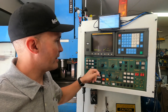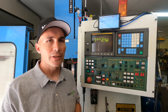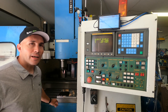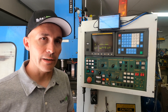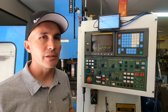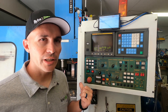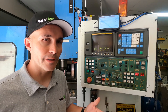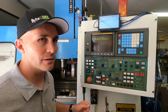In order to run it, I would basically put the machine in auto mode and hit cycle start. Let's say you've got your material already clamped down into the machine, like I've got over here, and you're ready to start putting in the zero position of where the tool needs to start out. When you design your model and generate your G-code in a post operation, you're going to tell it where the zero-zero-zero point is. So now we're going to move the machine to that zero-zero-zero point and tell it that that is your home position for the part. To do that, I'm going to move the machine in jog mode to get it close, then I'm going to use the handle to get it fine tuned.